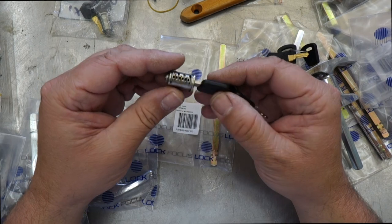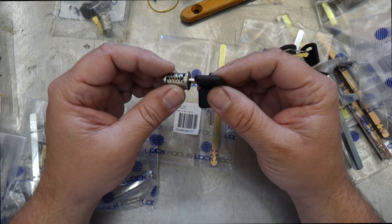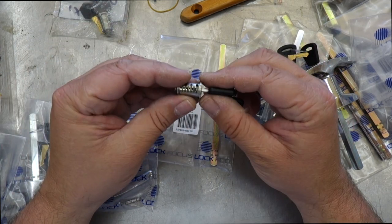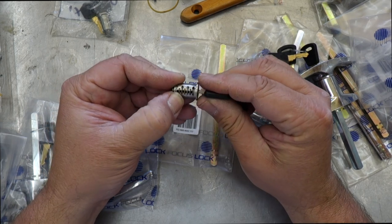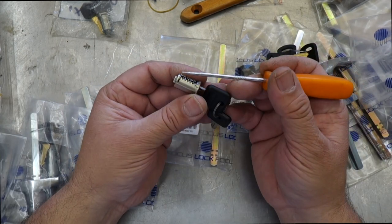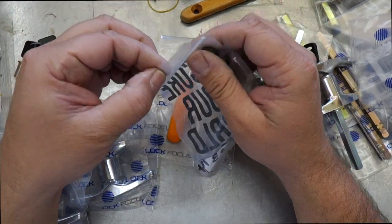Other products which have this feature are some of these Cyberlock locks. These ones here are for mailboxes, but they can also be used for desk drawers, notice boards, and push locks — there's a whole wide range of locks that this removable barrel will suit. Again, it's the same sort of thing: if you're lucky you can push it down and push that retainer in and it will be held in. If you're not lucky, you'll have to use a spike tool or a small flat blade screwdriver and push that down while you slide the barrel in.